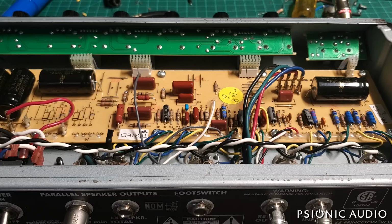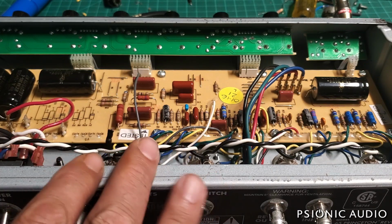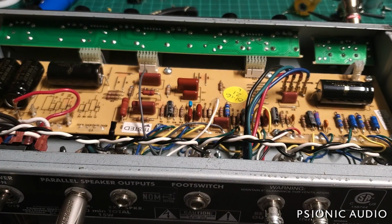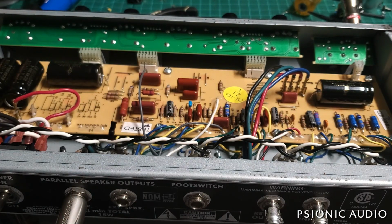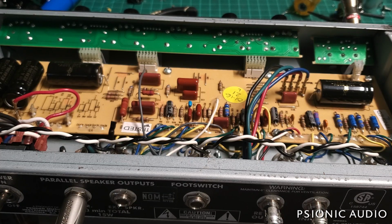And I'm going to make sure that the mismatch is the tube and not the amp itself, though with my experience with the Apex matching, I have suspicions it's just a poorly matched pair, matched at a lower plate voltage and current draw than you actually get in an amp, even a little Princeton. The brand new Apex tested Tung-Sol 6V6s were mismatched, as I said, and at the coldest bias, one was at 60%.